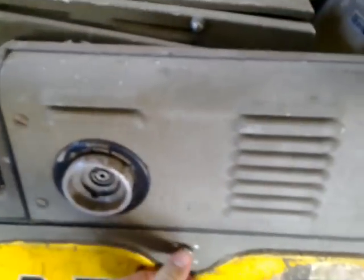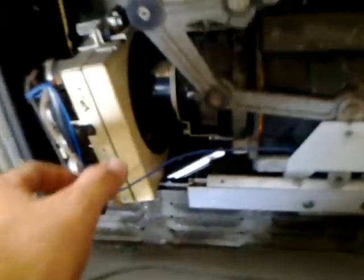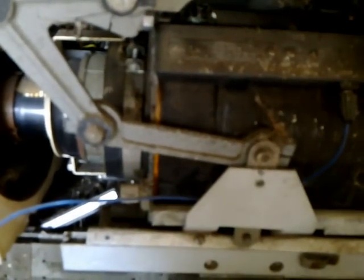I'm going to open this side flap and show the Image Orthicon tube assembly. There's a few dead daddy long legs there. That's the Image Orthicon camera tube yoke — pretty big it is. The tube is inside; I'm not going to attempt to disassemble it yet. This uses a four-and-a-half inch Image Orthicon tube, which is a lot bigger than the Image Orthicon tubes I have in my collection, which are three inch and two inch.